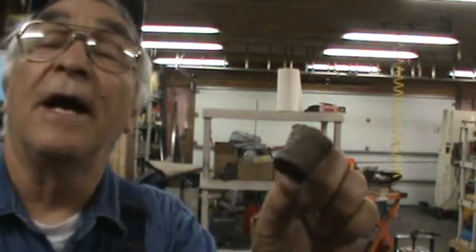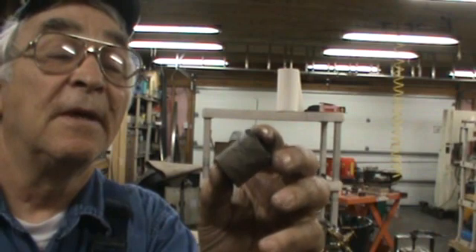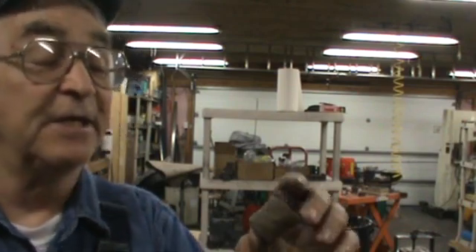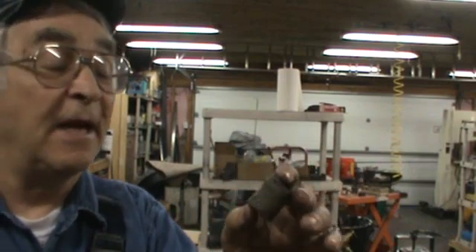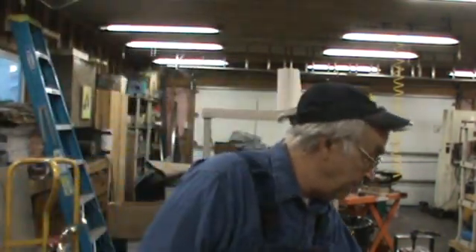This was a crucible — it was a little R9 electro furnace crucible — and I used it in the micro mini furnace to the point that it was just about totally eaten away. So I went ahead and just coated it with the coating, and I'll probably be able to get 8-10 more melts out of this. It's a pretty simple process.